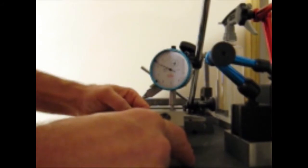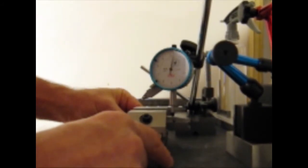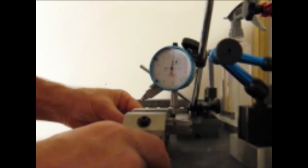Let's go back — I'll stop where I entered and you can see where the dial stops. Let's exit. We'll go over to the other side of the firing pin and enter. It should go right to the zero. Right there — that's about 3 thousandths of an inch over zero.